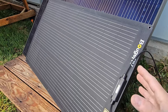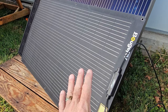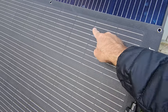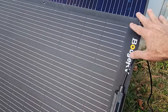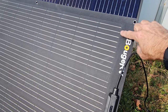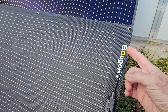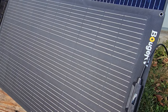It is flexible, but not flexible like paper — I would call it semi-rigid, but it does have a lot of flexibility to it. There are two layers of fiberglass in there to give it flexibility but also strength to protect the cells. You can notice this little line running down here, cutting that square in half — that's what they call half-cut cells. That separates the halves electrically so that if one part gets partial shading, that doesn't necessarily affect the other part. And on top of each of these lines are bus bars. It's a 10 bus bar design, which lowers the overall resistance, makes the panel more efficient, and more resistant to partial shading versus a typical five bus bar design.